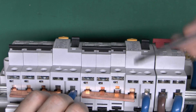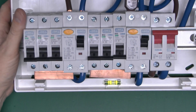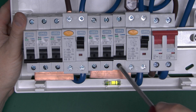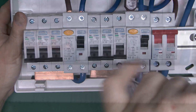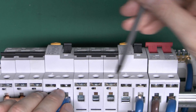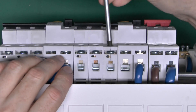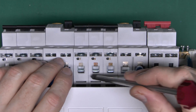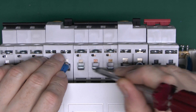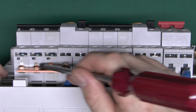You'll also notice in this case that the breaker itself has been pushed forward so it's not actually in line with the others any more. So that's a very easy thing to get wrong. If you're just looking at this from the front and it's low down on the floor, you wouldn't necessarily notice that had happened. So if taking this out on an existing one or even putting it on a new one, you do need to make sure that all of these are fully open and that the bars go into the correct place, even if it means getting a mirror on the floor just to see up there and make sure the holes are all actually fully opened.